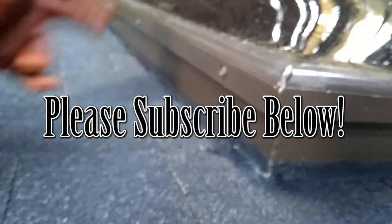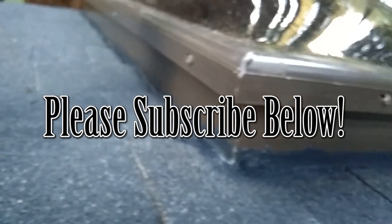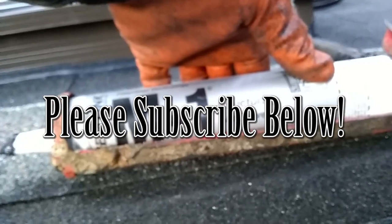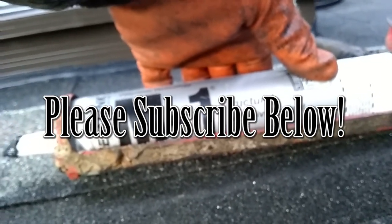Sorry about all the movement — trying to keep this steady but it's hard to. If you look down that row there, you can see it's all sealed: glued underneath the shingle, and then on the side of the shingle, and then on the top it's glued, and then underneath the shingle, and then on the side of the shingle. Your caulk is only as good as the grade that you use, so don't just buy this stuff from Home Depot — it's not going to work.